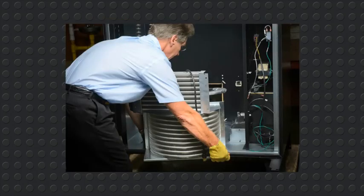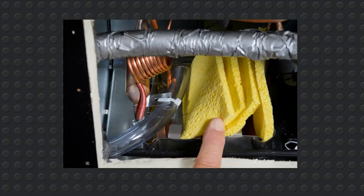Now, with the power plug placed over the top of the evaporator, the unit can be placed on the front of the cabinet with the condenser and evaporator facing out. Slide the unit back into place, locating the condenser extension notch and the bolt holes. Once the unit is in place, insert the drain tube through the wire tie and again make sure the sponges are in the alignment slots.